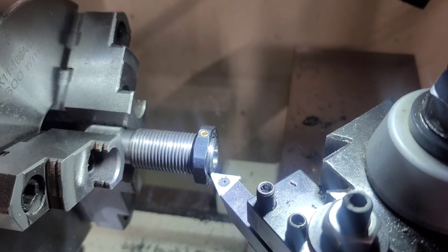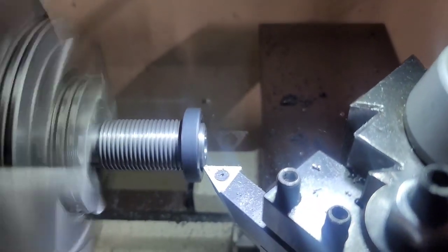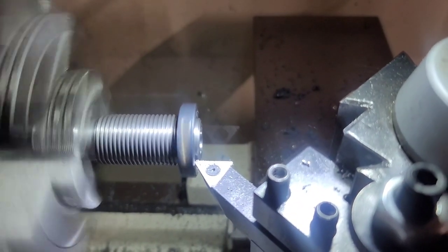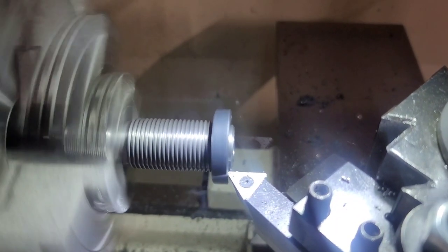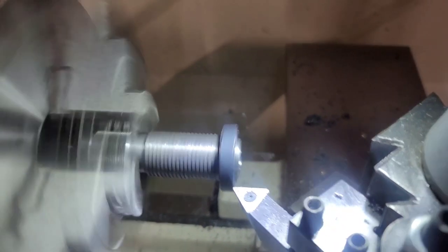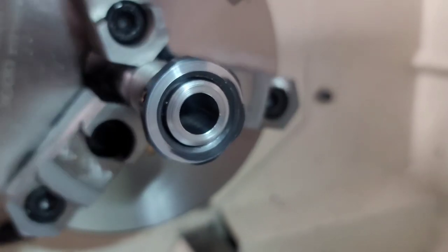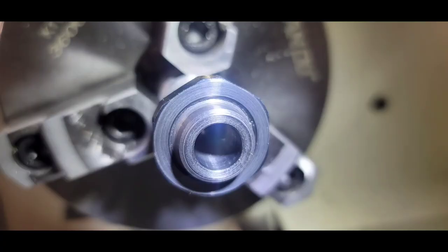The lock ring is another important factor that many might miss. The lock ring could actually make your die sit canted and off center. I'm going to take a one-thousandth facing cut and show you how off this thing is. As you can see, I'm only getting 50% contact. After facing it, that's looking much better.